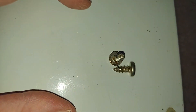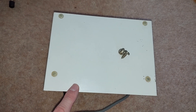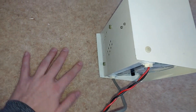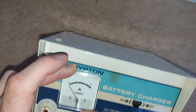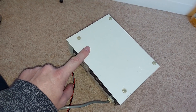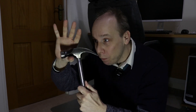There are the screws and there is one of the pins I was telling you about. As we can see there are four of those pins on the top of the machine and there's one down there on the side, and there was originally one down there on the other side as well but that's missing. I've had a sneaky look through that little gap and I can see how those pins work — they're going to be a little bit of a pain. A pin like this has a central shaft that gets pushed into a rawlplug; the rawlplug then expands and holds the machine together, so what we're going to do is tap the pin all the way through so the rawlplug compresses and the machine will come apart.